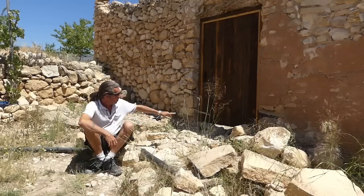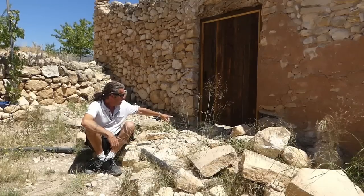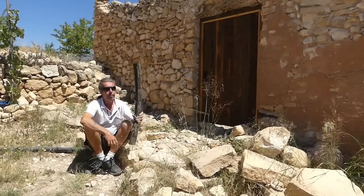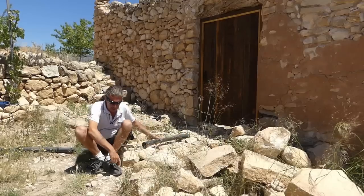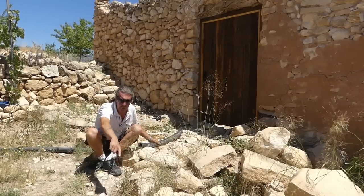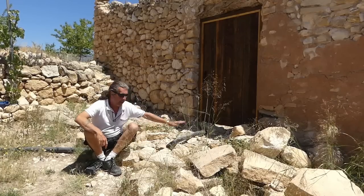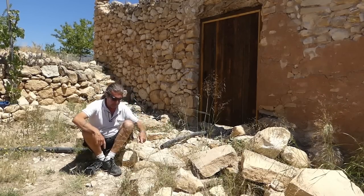Also, because that's a water drainage chute, if we put a step in there, particularly grass, the water won't be able to get out of it, so it'll just form a puddle. So we've got some of this plastic pipe that I'm going to run under here. You can see it runs around here, the water, down into the deposit. So if I put this under the stones here, we're going to make this nice and flat, hopefully, and the water will run down that.